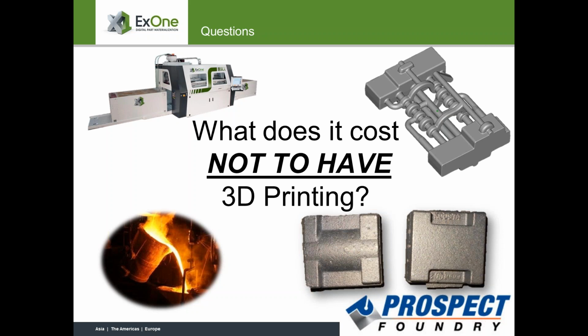Well, go ahead, Bob. Yeah, I'll start with this. Every casting has its own personality. This particular personality and geometry, and how many cores, is it just a single core? In this case, it was 4 separate cores that had to be put together. So the cycle time of producing one solid core for us versus ExOne's ability to create that one core has got to be an astronomical difference. We couldn't ever match them. We couldn't even come close to not only the accuracy, but just the speed in which it's done.